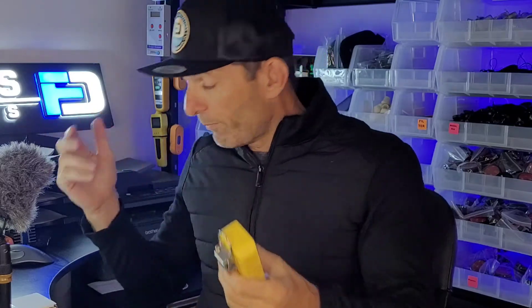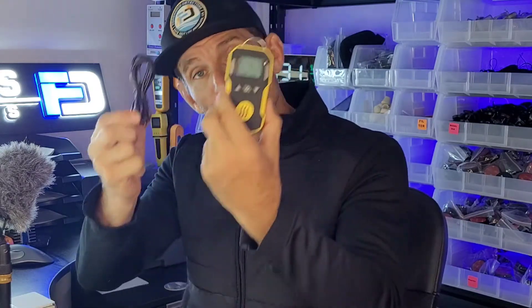The detector shows you the instantaneous concentration of what it's detecting. If it's an oxygen detector, for example, it detects oxygen at 20.9% in the atmosphere. In this case it's a hydrogen detector — zero to a thousand parts per million — and it's detecting zero PPM because there's no hydrogen in this room. With just the clip, you can pop it on for personal protection, such as walking into a battery room. This is called diffusive sampling, because the hydrogen molecules diffuse onto the sensor without being forced.